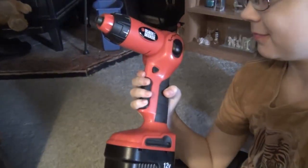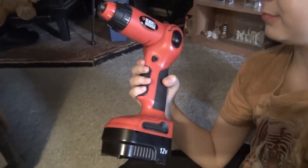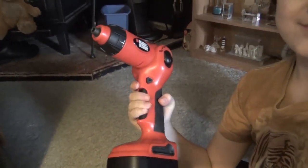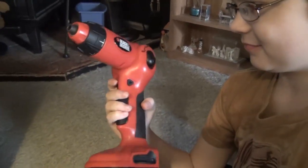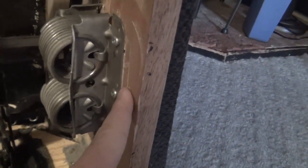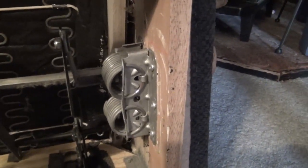Yeah. Got a little help from my screw gun. Yep. If you want to turn it on, go ahead. Because guys, honestly, I tried to screw the things in by hand. And you can see right here, this line right here, that's where it's supposed to be up to. Well, I got it in there as good as I could and put the screws back in. Just to make sure I wouldn't split the wood, I went ahead and put some soap on the end of the screws. My brother taught me that little trick a long time ago. Once I got that in there, it seemed to work.